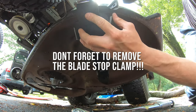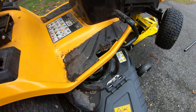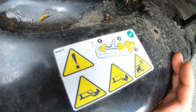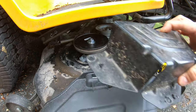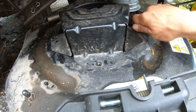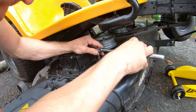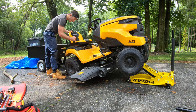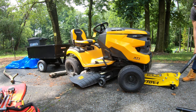Lower the deck again and double-check all your belts are routed correctly onto the pulleys — there's a slight diagram right here if you need it. Once you can confirm all the belts are routed correctly, go ahead and reinstall the belt cover. It's going to take three 8mm bolts — I would recommend starting these all by hand, then zip them all down. I could not find a torque spec for these, so just snug them down — all it's holding is a belt cover. Raise the deck back up once you're all done, and lower your jack back down slowly. And that is pretty much it.